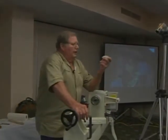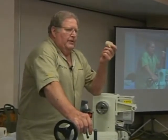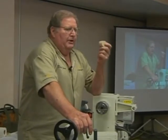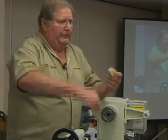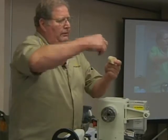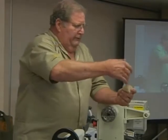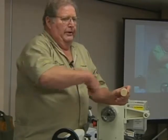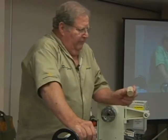When I do turn them around, I just turn them in a cylinder, and I take a V-block and clamp it down on my table with the pointer underneath, hitting the center of the V. Once it's clamped, you throw that on there, and you've already got the high point, top dead center. So whatever you lay out, you just hit it, and you've got straight holes. I put a quarter for the large one. I use an eighth for the roost hole.